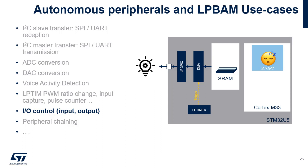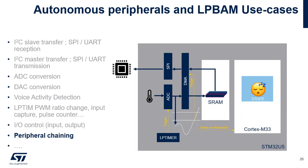The low-power timer periodically requests a DMA transfer from a memory buffer to the low-power general-purpose input-output module. For instance, a LED can blink while the Cortex-M33 remains in Stop 2 state. This last scenario demonstrates the collaboration of multiple units without involving the Cortex-M33. The low-power timer periodically triggers an acquisition sequence in the ADC that relies on a DMA channel to transfer the samples to a memory buffer. When a particular threshold is exceeded, an analog watchdog triggers another DMA channel that automatically transfers the latest samples to an SPI controller, where they can be stored in a non-volatile memory. Another analog watchdog is programmed with a second threshold that, once exceeded, causes a wake-up of the Cortex-M33.